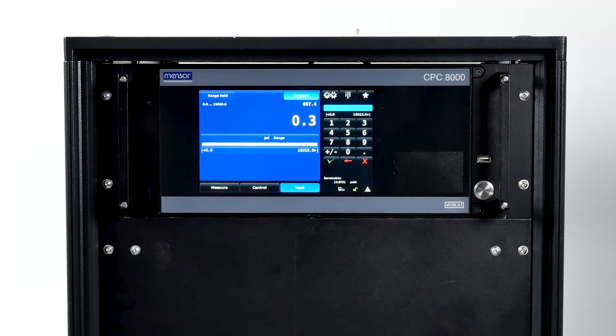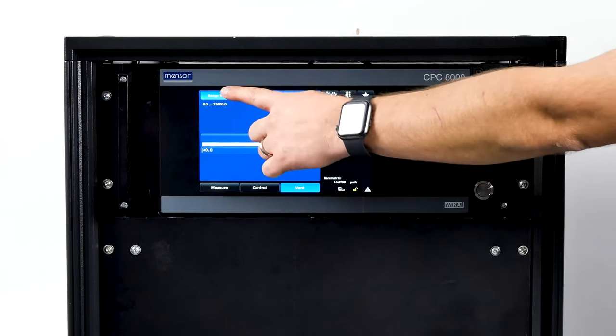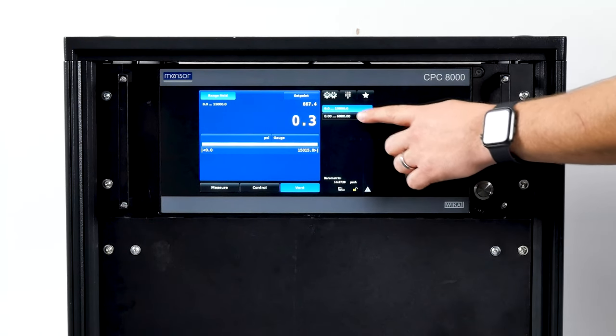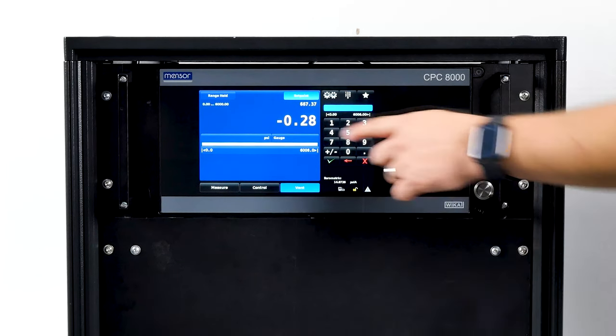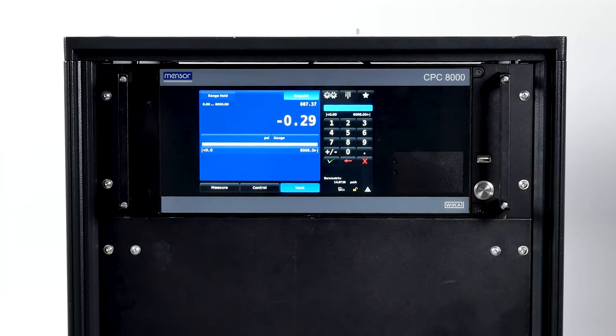The upper left corner of the screen shows the ranges. If a second transducer is installed, the user is able to choose one of the internal reference pressure transducers with this button. Pressing this button will show the transducer assignment list — the active range is highlighted. Press another listed range to change it. If the CPC-8000 is under pressure, no other transducers can be chosen. The large number in the middle of the screen is the live pressure reading at the sensor connected to the DUT measure control port. When this reading turns green, it indicates the pressure is within a user-defined stable window. A white reading means the pressure is outside the stable window. A red reading indicates the reading is 7% greater than the upper limit of the active transducer. Inherent internal safeguards are set to prevent overpressure.